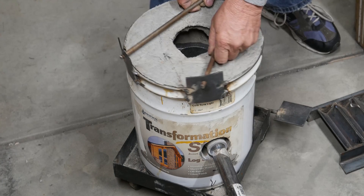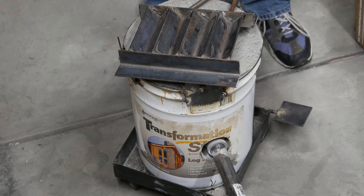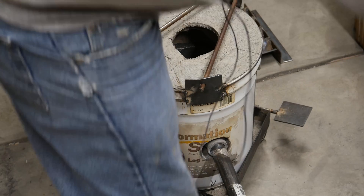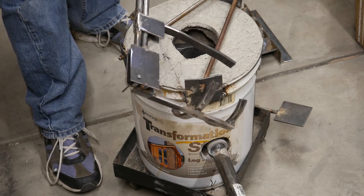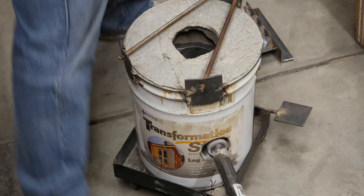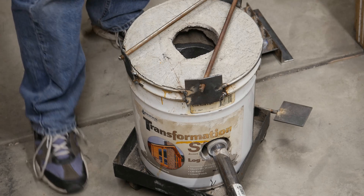Let me close the lid up here and show you. I made an ingot mold just out of some angle iron — just welded that up. I also made crucible tongs and I'm looking forward to seeing these tongs in action. And I made a dross scraper as well, just so I can reach into the crucible and scoop out dross. So that's pretty much it.